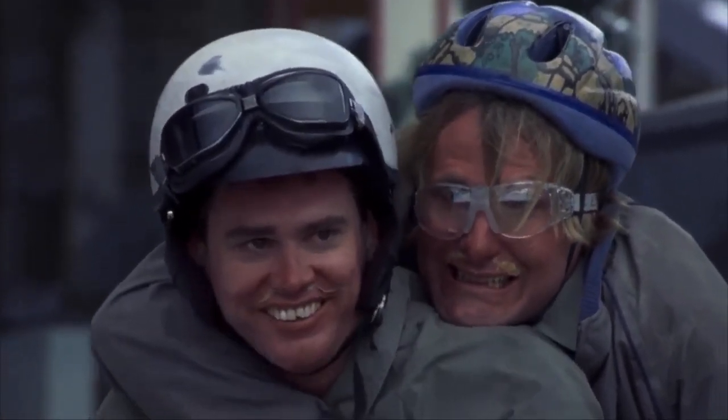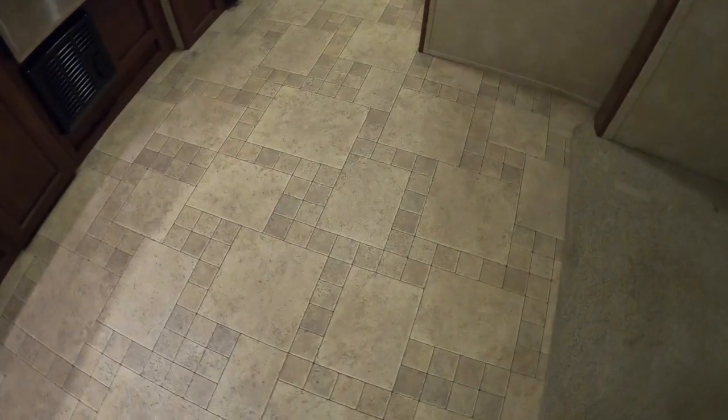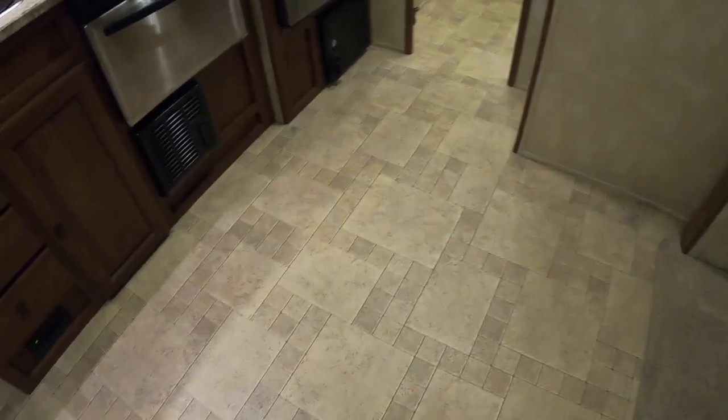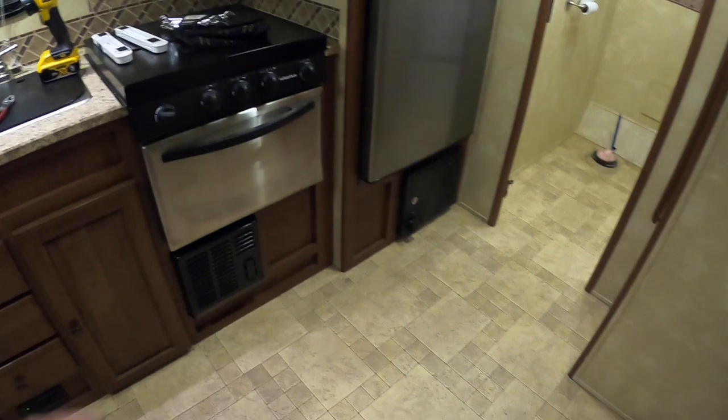We're there. After doing some research, this floor is perfectly flat. All the pattern is actually just printed into it like an image. So it's a perfectly flat piece of linoleum. And upon some more research, I've seen people just take the laminate and go right over top of it. That way, you still have a barrier. This deck is totally sealed from any moisture, anything that were to spill onto the floor.